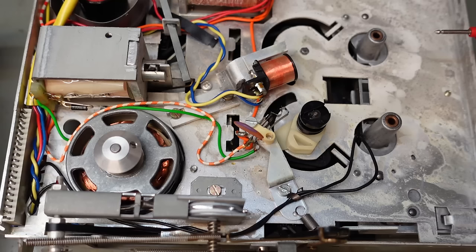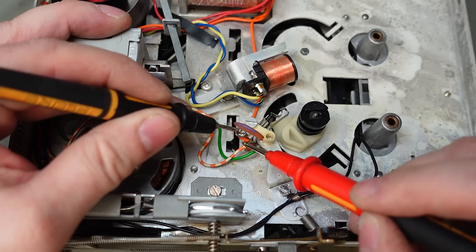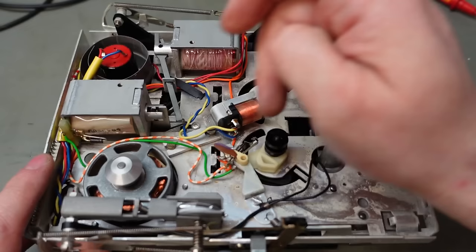Now these are out of the way, I'm just wary of any switch contacts, which may be somewhat tarnished. I've got this switch here, which I think works on this cam, yes. So what I can do is put that back, just check we've got continuity. And we have. Oh, these are good. Absolutely fine. Everything looks quite healthy on here. It's all free to move. Things that spin that should spin.